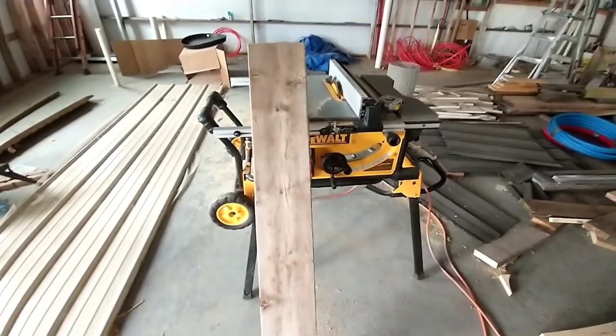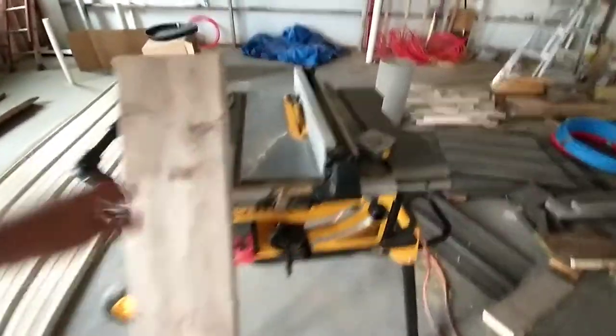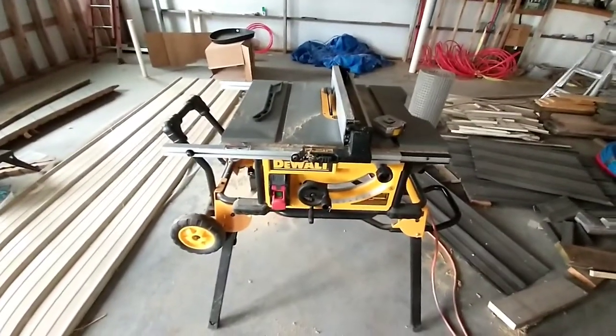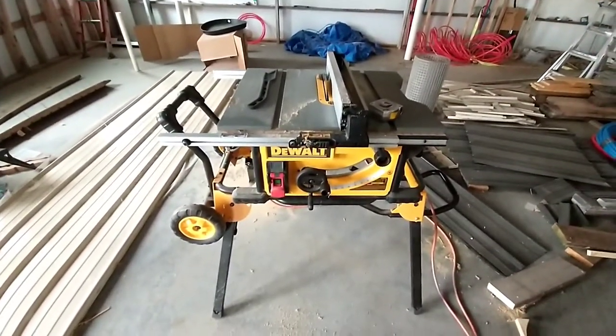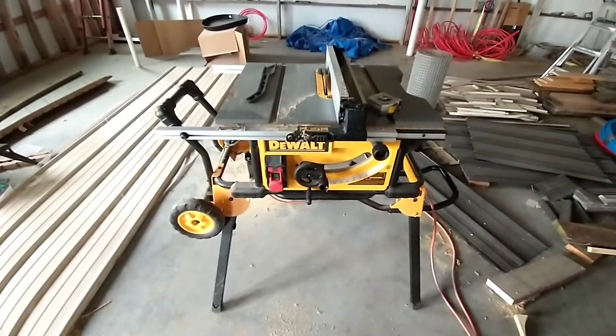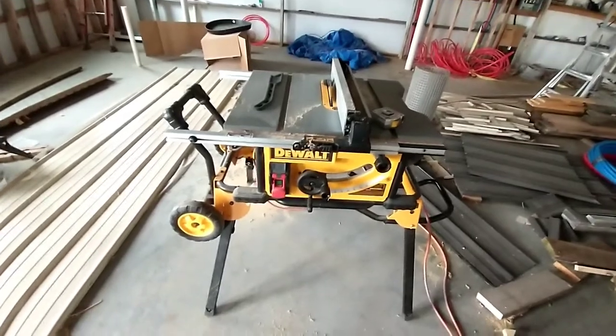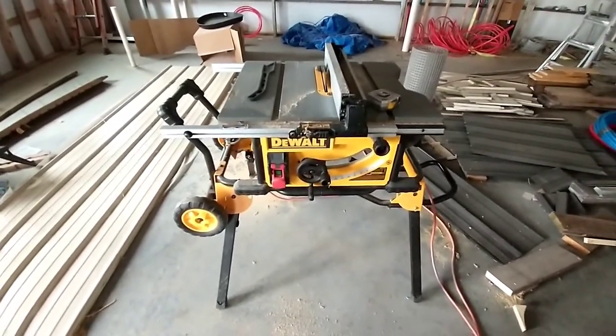This is the first time I've ever done this so I don't know how much sticker stain actually happens, but I've heard about it, so I thought I'd try using some dry wood. I've got my DeWalt table saw set up with a fence to rip three-quarter inch thick stickers, and we're going to make them four and a half feet wide — that'll give me enough room to stack some of those boards based on their widths.